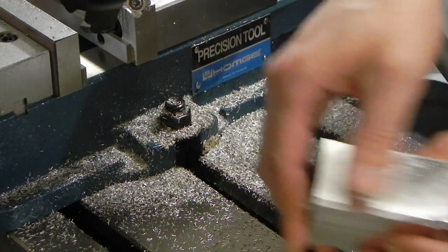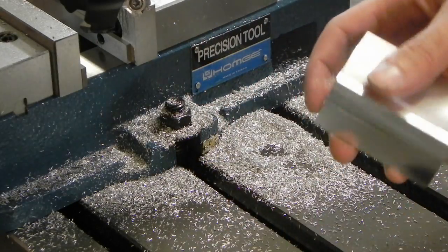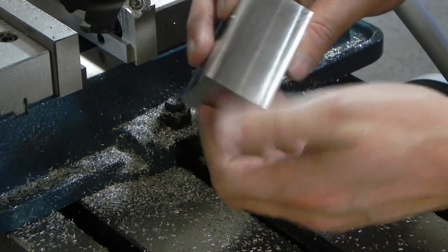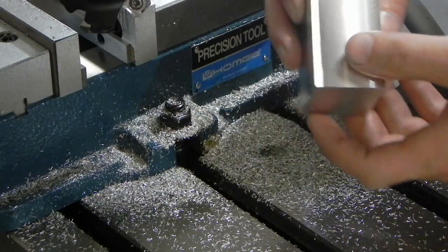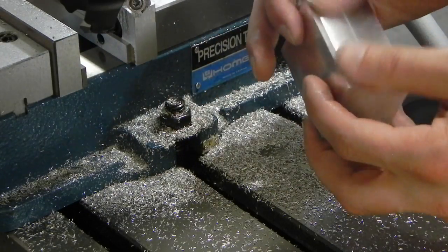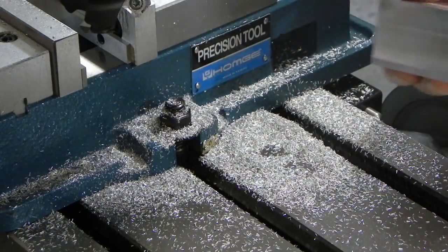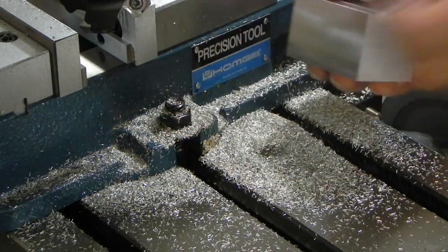See in there, you can see that. You guys see that? Yeah, you can see it there. You can see the surface finish. It's okay. Actually, I think because these are aluminum inserts and this is only a 1.5-inch face mill, and this mill only goes to just shy of 2,000, it's not actually generating enough surface feet per minute for these inserts. But I plan on getting a 2.5-inch one or maybe even a 3-inch one to dedicate just to aluminum and then use this one for steel.